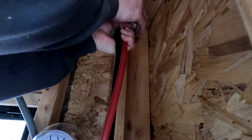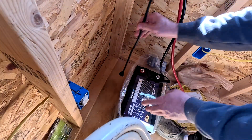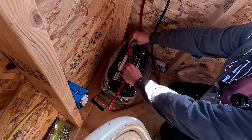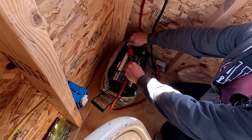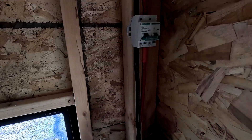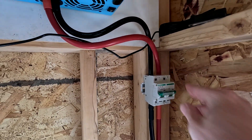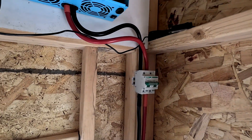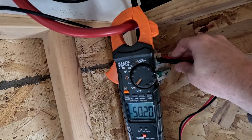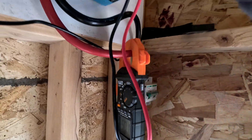The next step is hooking the battery up. We've got the breakers here — the breaker bracket hooks on right there. Our breaker up there is turned off, so we shouldn't be sending any power to the unit. Alright, we are all hooked up, battery connected, cables going right there. Breaker and inverter are currently off. Let's turn the breaker on first. We've got 50.2 volts on each side, which means we should have 50.2 volts at the inverter. So we've got power going all the way to it.